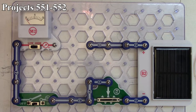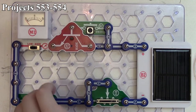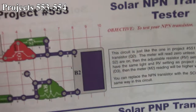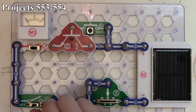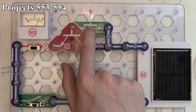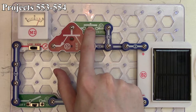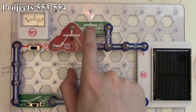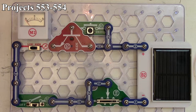That's project 552. Now we move on to project 553: Solar NPN Transistor. It's similar to the previous project — we put our NPN transistor in line along with our press switch to provide power to the base. When we turn our slide switch on, we see no deflection on the meter because the NPN transistor is not turned on. But if I press the press switch, energy goes through the solar cell into the base of the NPN transistor, turning it on, and current flows through the collector and emitter — we see that on our meter. Releasing the press switch turns the transistor off.